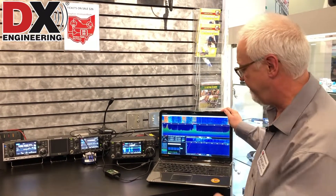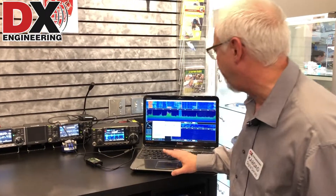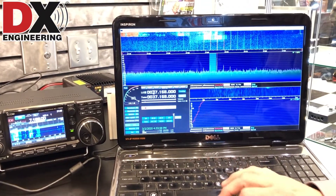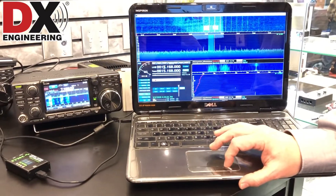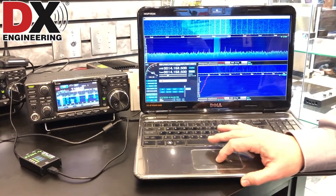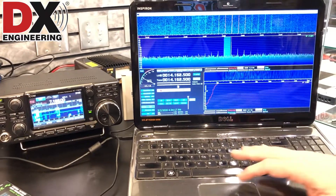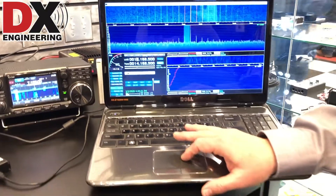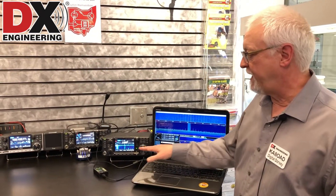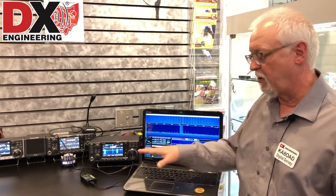One other nice thing about this SDR: if I turn off the rig control — go into options and turn the rig control off so I'm not syncing to the rig — I can actually use the SDR to go to other bands. For example, if you want to monitor 20 meters, I can go to 20 meters and set this up to monitor 20 meters independently. I would have my own volume control on the PC for the SDR, so I could actually bring up a different band on receive — basically two receivers off of the 7300. There's no problem with transmitting; when you transmit on the 7300, the antenna input to the radio is disabled, so you're not going to blow up your SDR radio.